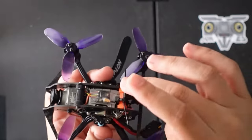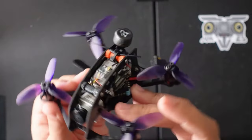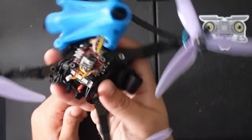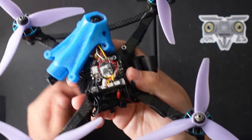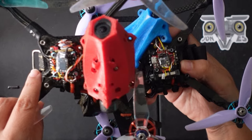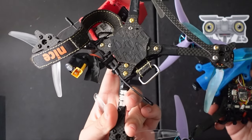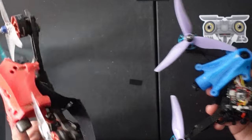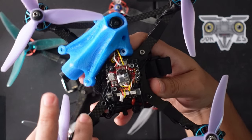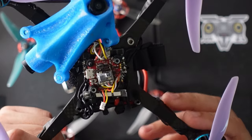On micros like this quad with an FrSky XM Plus, the price is low but look — the antennas are already chewed up and it's hard to know what to do with them. See how small the ExpressLRS receiver is compared to that. I tried the EP1 with the tiny antenna and it works great with a bit more range, but for most purposes I'd pick the EP2. Here's the EP2 with the tiny ceramic antenna — look how little space it takes up. Compare that to a crossfire in the same build type, and you see how much more room the crossfire takes, plus the space needed for mounting the Immortal T antenna.